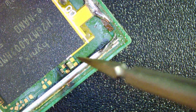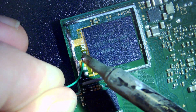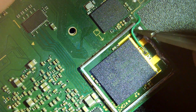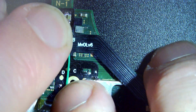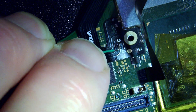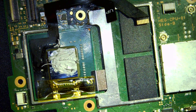There are little adapters on the ends where you can add a bit of extra solder to the caps, but I didn't bother. For the wiring, there are a couple of connections to do — solder one wire into the adapter itself, then position it so it comes out of the corner and wraps around to the other side. Push it in slightly so the cover goes back on without trapping the wire. Flip it over, snip the wire to the right length, and solder to the C points on the connector. Then add a little bit of Kapton tape over the solder points on the caps to prevent any potential shorts when you reapply the heat shield.